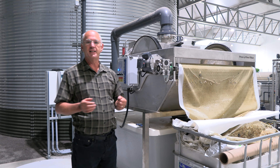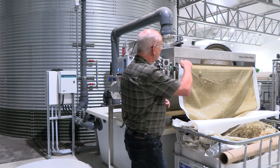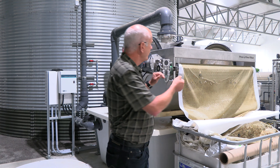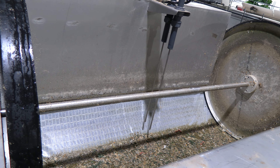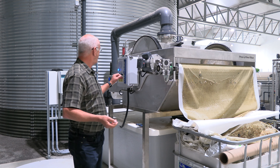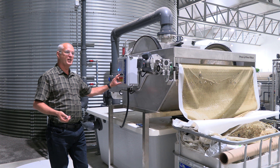When the cloth gets dirty, the water level inside the half pipe starts to rise up a little bit until it hits one of the two sensors that are there. There is a lower one and an upper one. The cloth filter scrolls forward about this much.